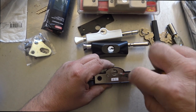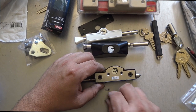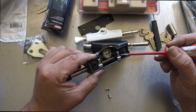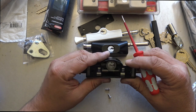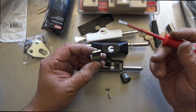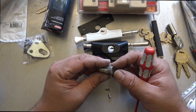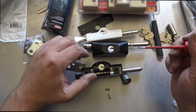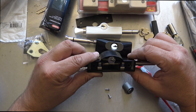Comparing apples against apples: the Carbine has a solid aluminium die cast case, while the Widco has plates and spring steel components inside. The Widco's retaining parts are just bent spring steel capturing the lugs, which causes that scraping spring sound. The Widco's cylinder is die cast rather than brass like the Carbine — no way you're getting a restricted plug for that. The Widco operates on three pins versus four on the Carbine, giving the Carbine more security. You can flip the Widco cylinder up or down for key orientation.